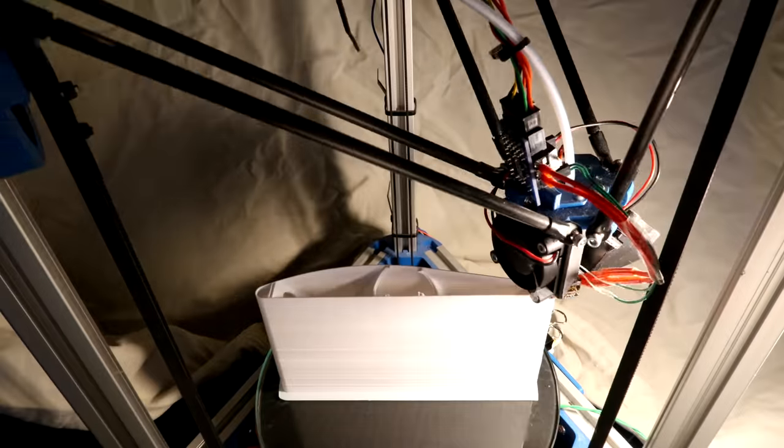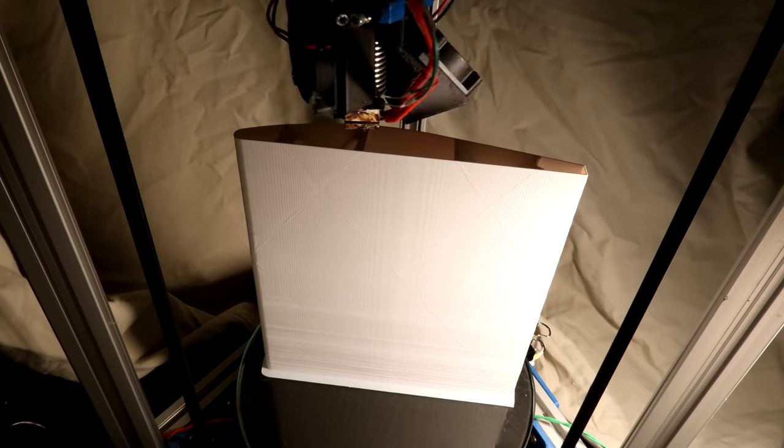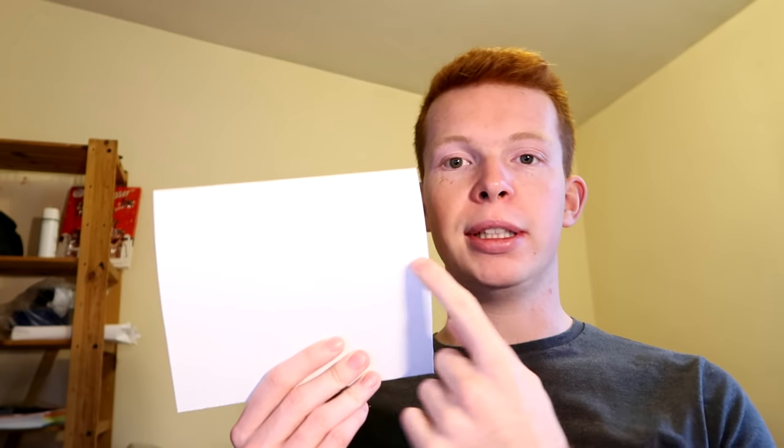This is the product of five hours of printing. It's got cool circular cutouts in the ribs. At a weight of 69.6 grams for a 20 centimetre section of wing, it's quite respectable. I thought putting the holes in the ribs would save more weight, but it only saved about two and a half percent of the overall weight. For a one metre wingspan it would weigh about 350 grams, which would probably fly not too badly.